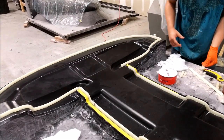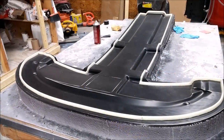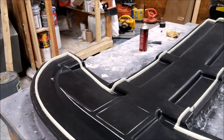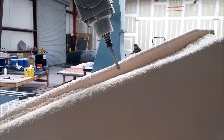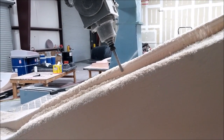Back to what's going on in the shop — this week we were working on the overhead console, getting the wax profile put on there and getting it all waxed up so that one's ready for a mold. Because of the amount of work it was taking to clean that wax profile out of a finished mold, we've actually ordered some silicone profile to see how that works.